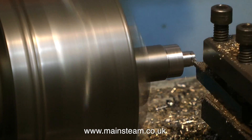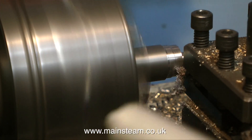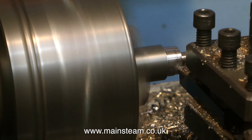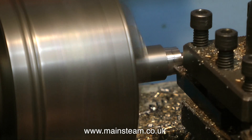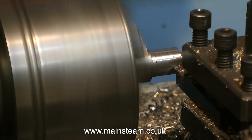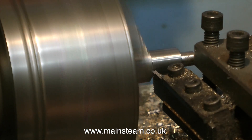On the original fitting, all that was down the centre was a 3/16 piece of steel bar, and that's not good because a couple of grub screws are just not going to hold this in place properly. What I propose to do is to make a special fitting with both ends machined to 5/16 of an inch in diameter, and I'm going to Loctite the parts together and finally pin them, so they're never going to work loose.